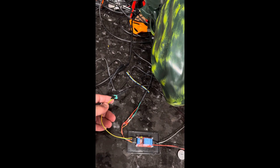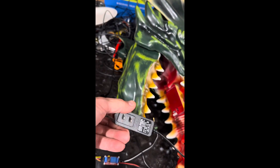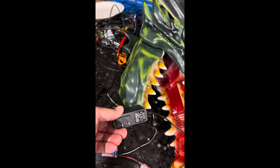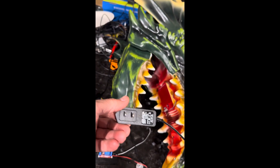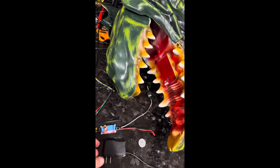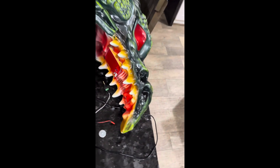So how it works is: this side of the relay is your power — it's 5 volts. So I just used one of these little 120-to-5-volt modules off of Amazon. You can also use any mobile phone charger; the majority of them use 5 volts. Anything that has a USB coming out of it is pretty much going to be 5 volts. You probably have a bunch of little chargers hanging around your house you can use.